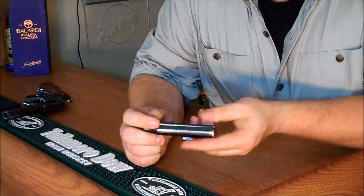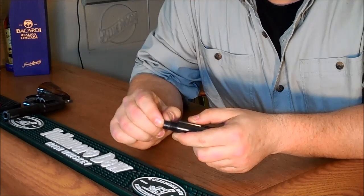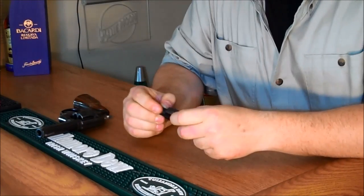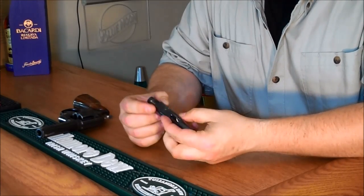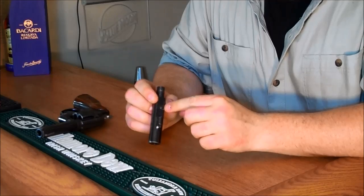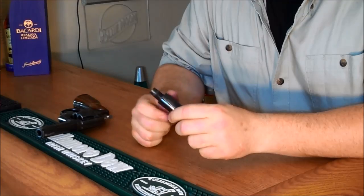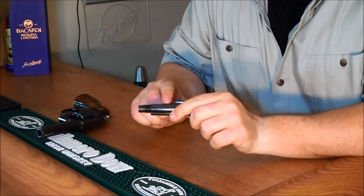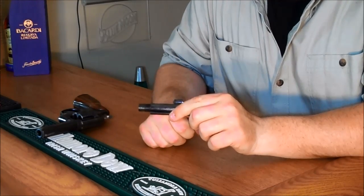Looking a little bit closer, you can see this is the bad barrel. The barrel just screws in here and it's got a little pin that goes through the frame. The pin doesn't really hold the barrel, but it in theory helps. Really the barrel's torqued in. You can see there's some damage here — that's because when I took it off in the vise, I was mainly worried about cracking the frame. The barrel actually has a visible bulge from where it belled out on the inside.